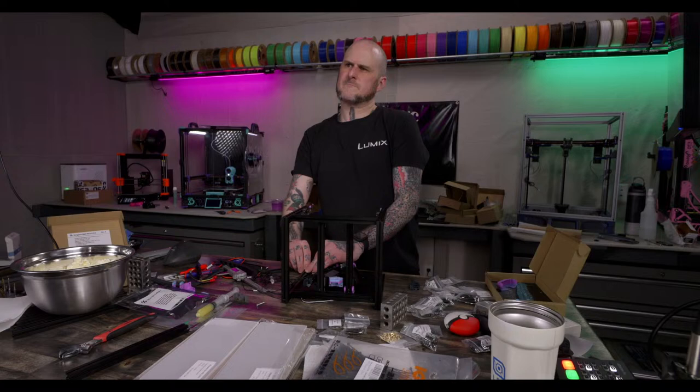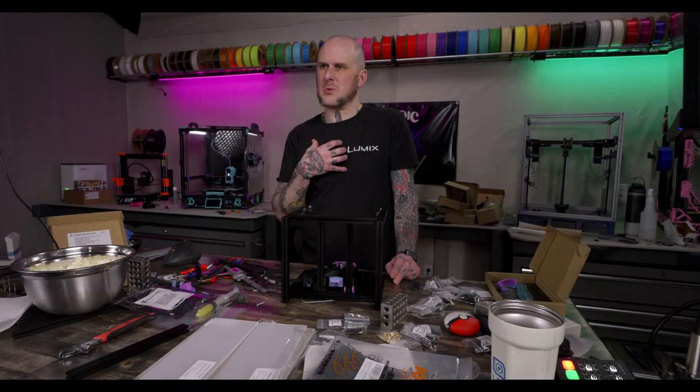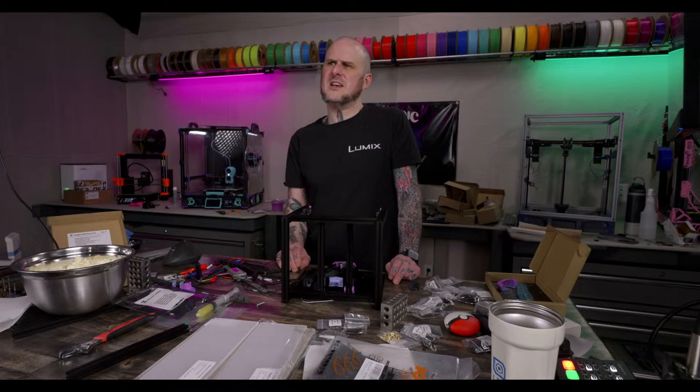Your V0 is loud? Why is your V0 loud? What kind of noise does it make? Mine's not. Mine makes noise, but there's something wrong with it. It needs a rebuild. So, yeah. Put in one nut, because I will be putting a Nevermore in here. Struggling with skipping steps when I go normal 0.1 speed and can't find anything wrong, so I ordered some new motors. Sometimes that's the thing.